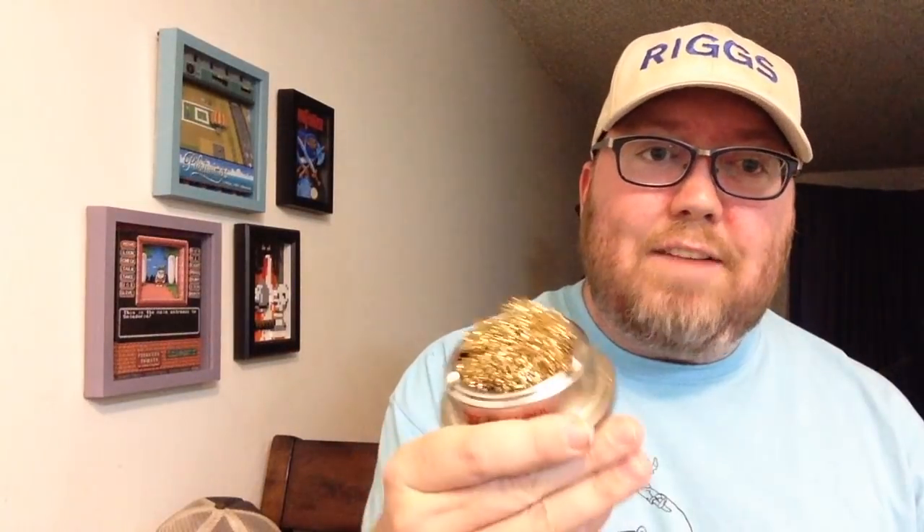When you're done using your soldering iron, you want to clean it off — one of these cleaner tins, you just pop it in there and it kind of drips the solder through at the bottom. And if you're looking for shells for your games, those are pretty common nowadays. You can check out eBay, AliExpress, Castle Mania Games, One Up Retro — there are a lot of ways to get your Nintendo cart shells. Sites like Mortoff Games and RetroStage.net also carry shells. As it stands right now, you don't actually need all of those parts. The EEPROM programmer, soldering iron, a few other things, and some EEPROMs — you'll be pretty good to go for your first couple of repros, with the other tools as later investments. I have other videos on how to do specifically an NROM game, an SL-ROM or SK-ROM game, 1-meg Super Nintendo games, Genesis games — it's all on here. Thanks for watching, make sure you subscribe, more tutorials on the way.